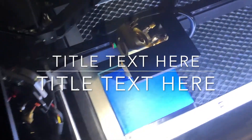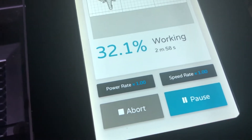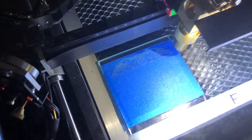The job is going to take approximately four minutes. As you can see, it's 31% done already. We have the power level set at 35 and it is engraving at 150 millimeters per second, so in about two minutes and 45 seconds we will peel the tape off and see the finished product.